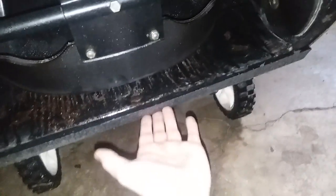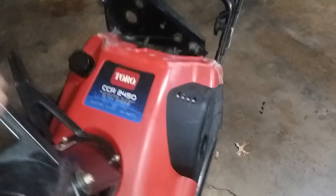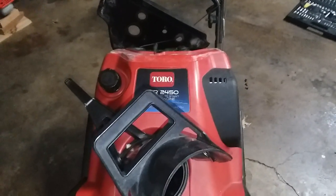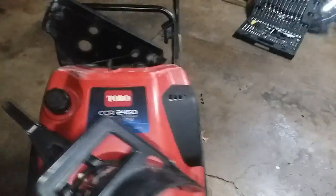I changed it for the first time by myself — I used to take it to my dealer and they did it, but now I started maintaining it myself. That's about it for maintenance on a snowblower like this — all you need to maintain a single-stage two-cycle. I know this is an older model, about 12 years old, a 2006. One more quick thing: before you do any maintenance, consult the owner's manual for proper details on how to change whatever you need to change. And always, for a two-cycle, make sure you have proper gas mix — this is 50 to 1 gas, so make sure you mix it correctly. I hope you enjoyed today's segment on maintaining snowblowers. I'm Andy's Lawn Care. Please subscribe to the channel if you haven't already, and I'll catch up with you in the next one.